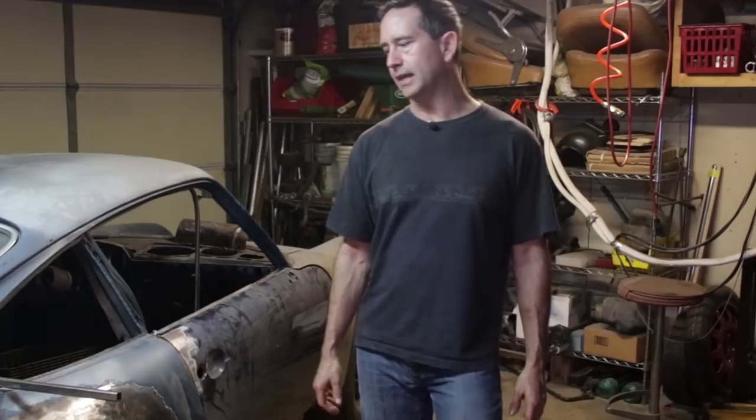Before we get started, last week I took a little bit of criticism for welding these flares on without keeping safety in mind. Definitely not a good idea to weld in shorts without wearing the right gear. That's great feedback — I totally agree. I'm wearing pants today. Even with TIG welding at small amps like 20–30 amps, you still should wear UV protection.